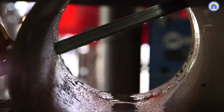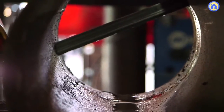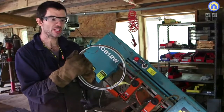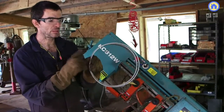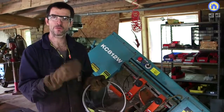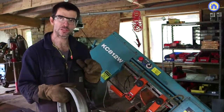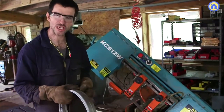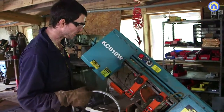The critical part is you can work on things that are thicker. You have teeth on the blades, and the piece you're working on has to be thicker than the distance between the teeth on the blade. You have to have like two to four teeth on at the same time. The only disadvantage is you can't cut very thin stuff, but it works great especially for solid shafts, which you just let the machine go pretty much.